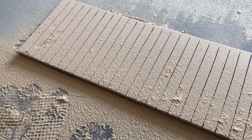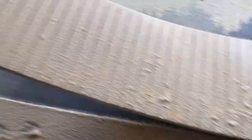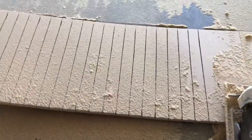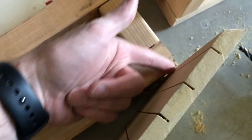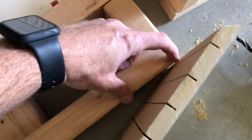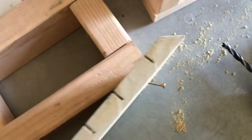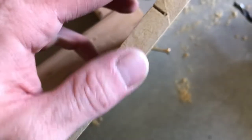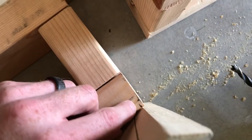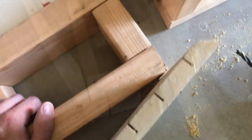I've been lining up the front of my saw and following the line as I go along. MDF is better quality — more dense than particle board — and this seems like the best way to go for curving that step piece. As a temporary measure I put in a screw on an angle so I can draw on paper what angle this is supposed to be cut, because I want a support piece on the inside. My board is also a little too short, so I'll use the miter saw to just slice this edge off.